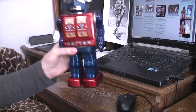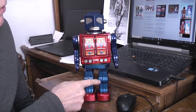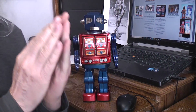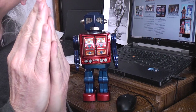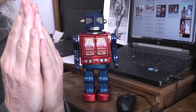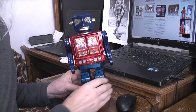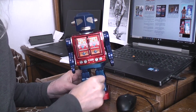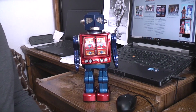The other problem was both legs. Each leg is tin and pressed together with a seam in the middle, but the seam isn't totally solid — the two halves can shift a little bit, and if they do shift then the leg kicks out. When I received this robot it was standing crooked because both legs had shifted their seams. I could have just lined them back up, but they would have shifted again.